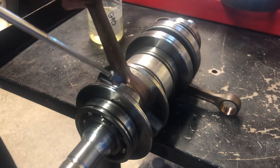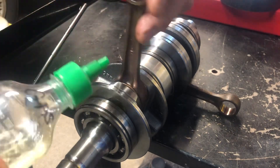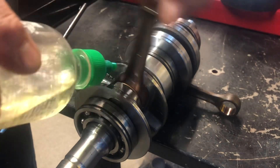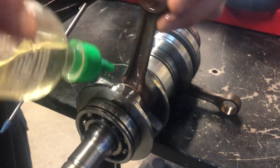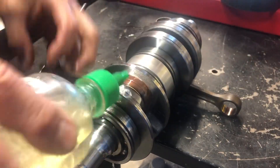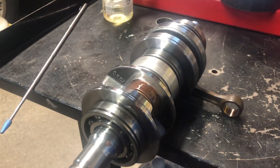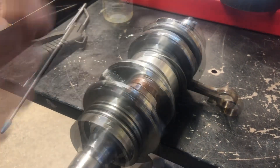I need to make sure that all the oil and everything is washed out and it's absolutely bare in there. So what I do is put some gasoline in there — it's the same as it says in the book. You should wash this with gasoline: pure gas, not gas with oil, but pure gas. Let it roll around a little bit and make sure I get it nice and clean. Then I'm going to get the air blower and blow that off so it's dry. I'll do the same on the other connecting rod. I swapped ends — now I am on the PTO big end.